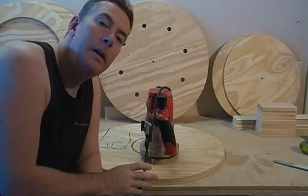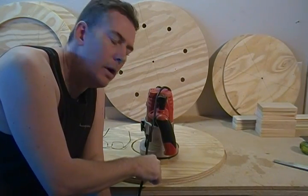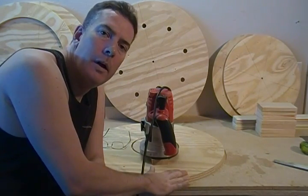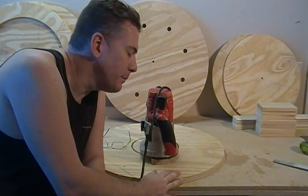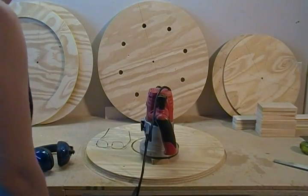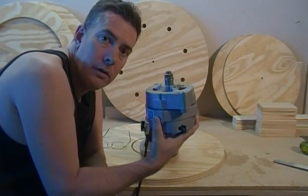I'm finishing up an optional operation right now on one of the two-foot diameter circular pieces that we have here. This is the base of our turbine — this is what you're going to fix down to wherever you're going to mount your turbine. The reason I'm cutting this 8-inch circle out is because it gives you access to mount your hardware from underneath the turbine.